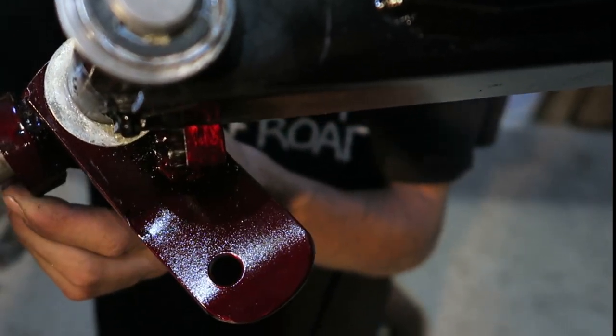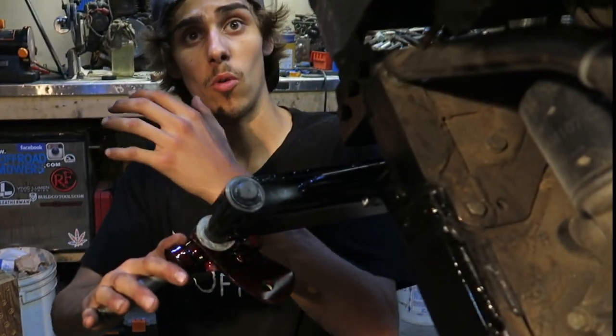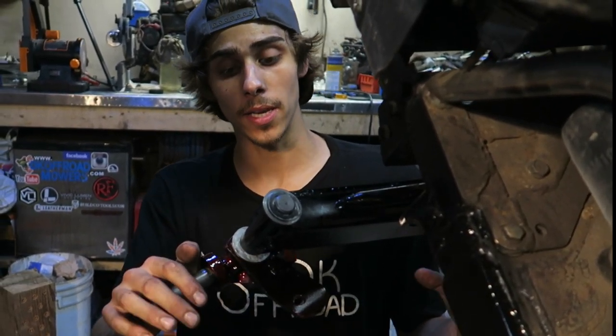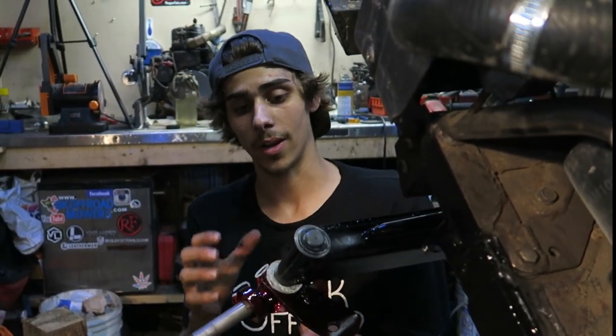So now when our tire gets pushed up onto a rock and you're trying to drive the whole mower over your front axle, over the spindle, it's going to rely now on this plus the internal rack and pinion stop there to stop your spindle from trying to oversteer or understeer.